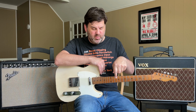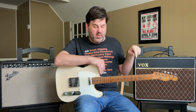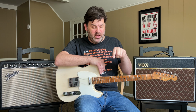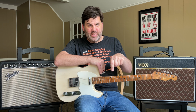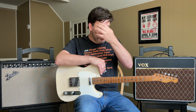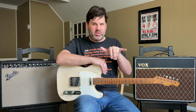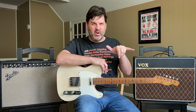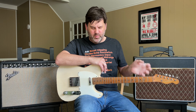So the signal is AB box, buffer with isolation transformer, into the Deluxe Reverb. The Vox is going into a Boss RV2, a late 80s digital reverb set on the plate setting. What that does is even things out, because now both signals are buffered and both signals have reverb, so you're not hearing one overly dry. And of course, I'm trying not to use too much reverb.